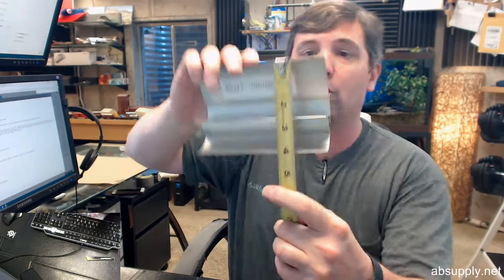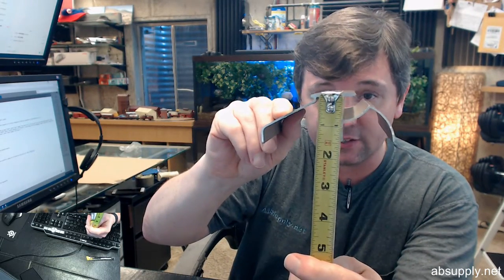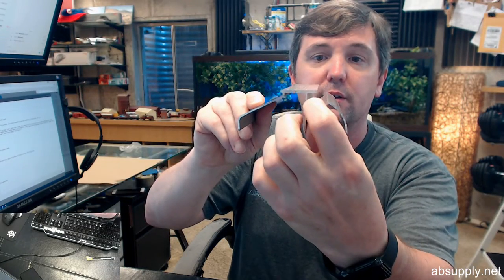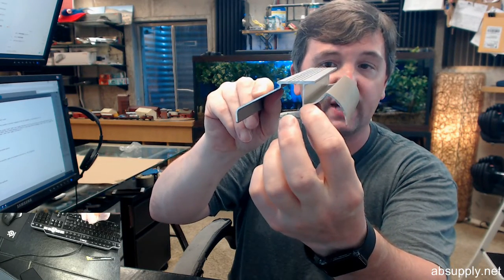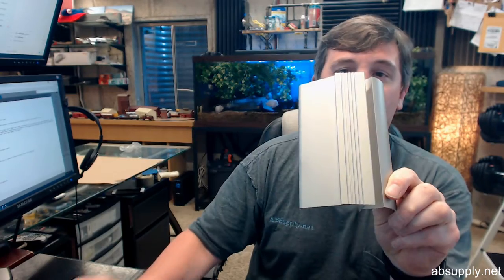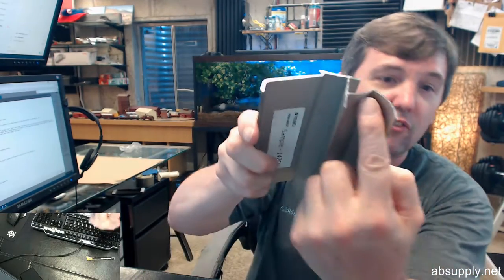Now, let's talk about it. The 147, we spoke about it being synonymous with its dimensional properties. 4-inch wide, and then it's 1.5 inches tall. So this is on the high end, certainly, of interlocking thresholds. This is water return. Let's talk about that. You see the significant trough that's here. Okay, and you can see that trough run down here, inside of here.